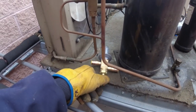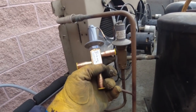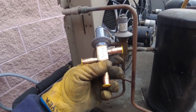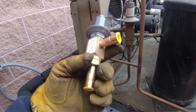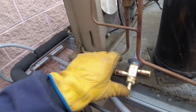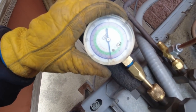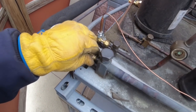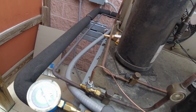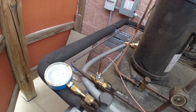I'm going to have to sleeve this unfortunately — these were half-inch valves. As you can see, you have the LAC 4DS 100-180, and unless you specify the size it appears you've got to sleeve it, which kind of sucks because it's more work that probably didn't need to be done. That side was also pulled into a vacuum, so it must have either — I don't believe the solenoid is powered by anything inside — so I'd say it just sucked in reverse and got through.